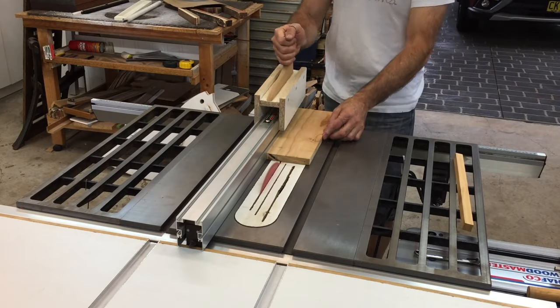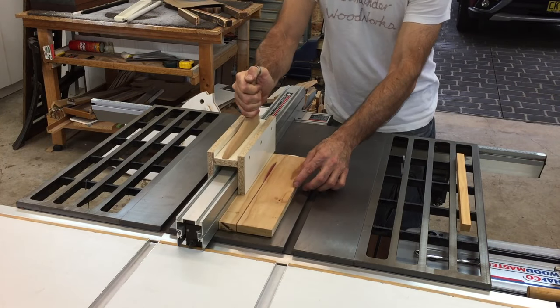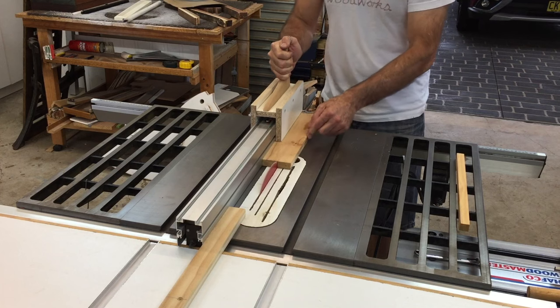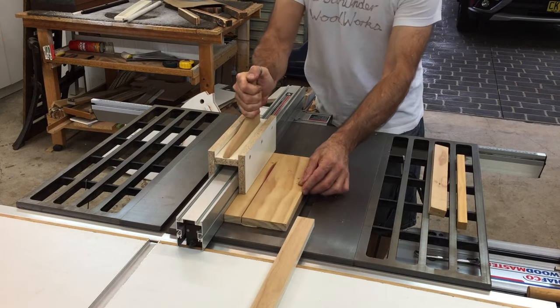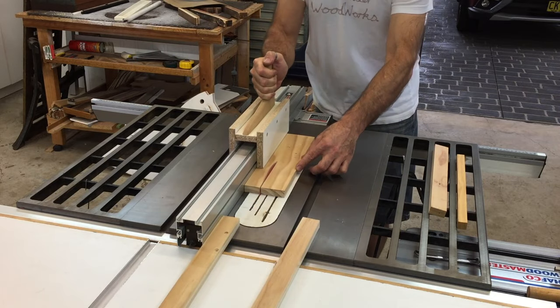I started by cutting four lengths of 19mm pine board at 38mm wide so I could glue two together to make two square lengths of timber for some old rollerblade wheels to mount to. These were going to make the wheel assemblies.